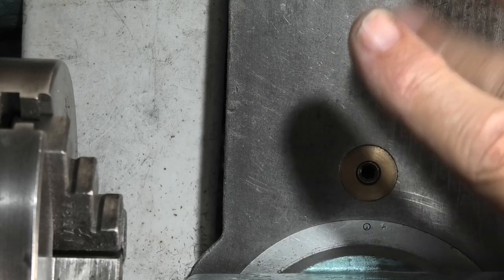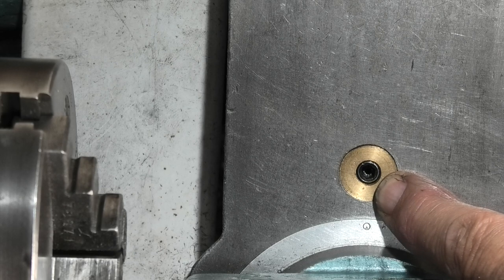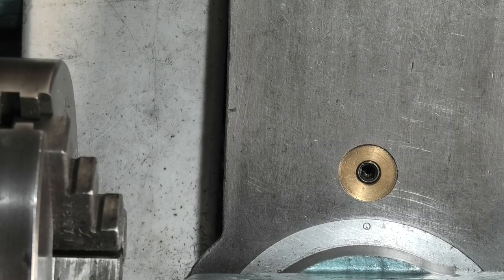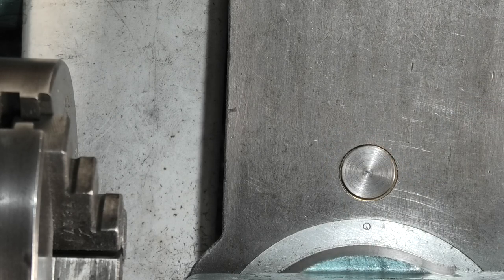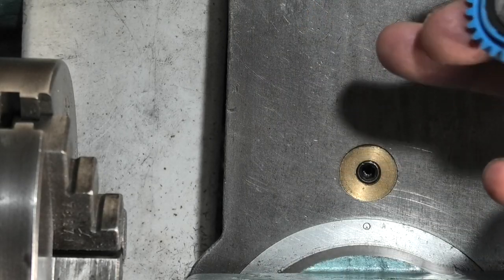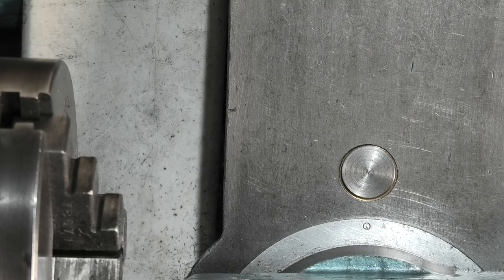Now this is the hole — I'm trying to stop any swarf going down. I drilled the grub screw out so I can put oil in there and it will go straight into the nut. And this is the part we've just made — that should go in there, covers there, stops any swarf going down. Now when I want to take that out, all I do is take a magnet, put it on the top, and it takes it out. That's just a little cover to stop swarf going down the hole. Well, that's it for today, hope that was interesting, hope it was useful, and we'll see you next time on Renauts Engineering.